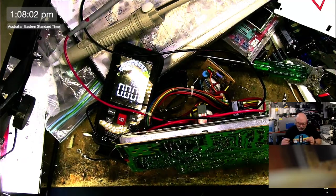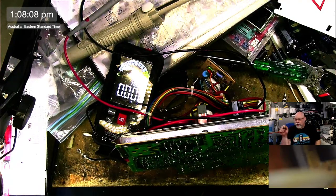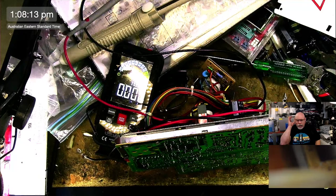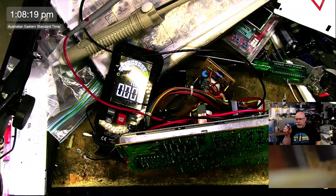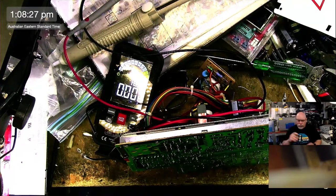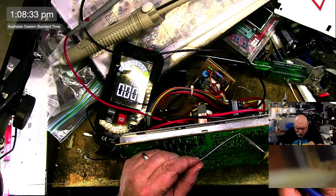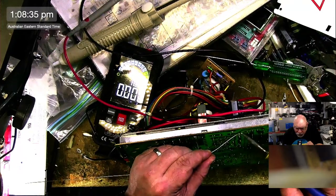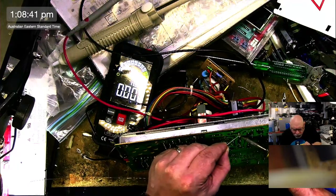Yeah, I was thinking of starting, well, it's very easy to get hold of a 12 and a 5 volt power supply that I could rig up to a battery without too much difficulty. I did find a little step-down type thing. So if you put in 16 volts to this thing, you could get it to output whatever you wanted, anywhere between like 3 and 12 volts or something. And I was just thinking, if I find myself a 16 volt battery operated power supply or something like that, I can then step down to whatever I need. But we'll figure it out.